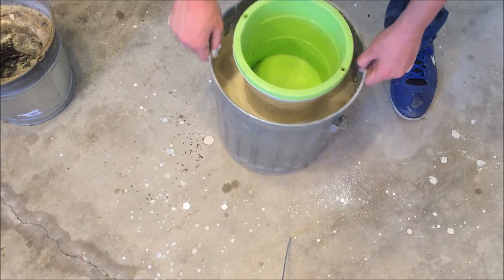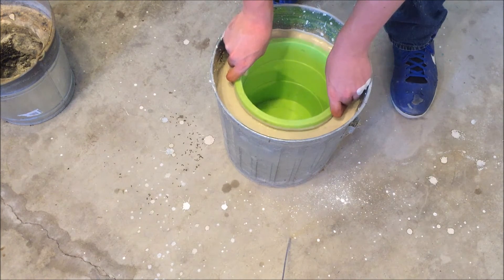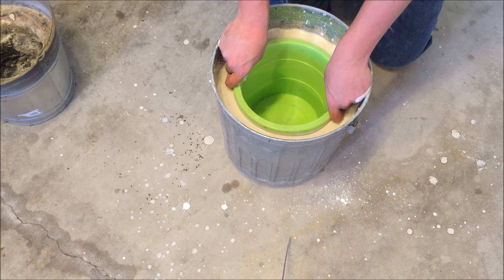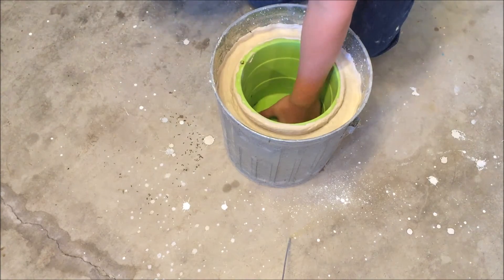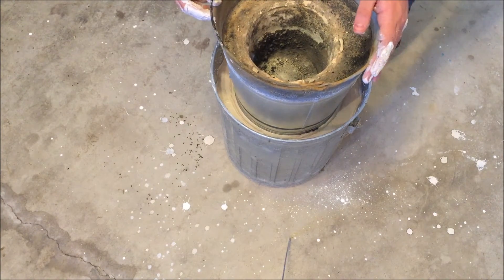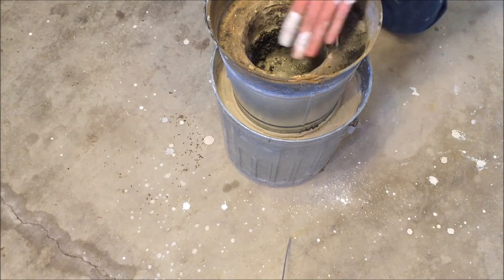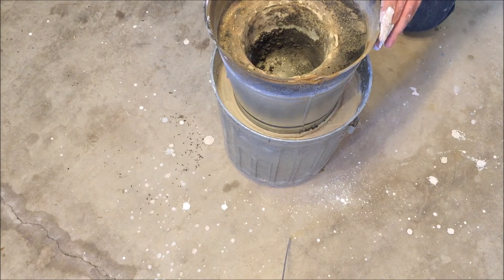Back to the foundry itself. I'm going to push this down. What you want to do is hold this here for a good amount of time until it sticks. You'll feel the plaster of Paris and sand mixture start to set, and that will feel like it's getting warm. You'll feel it's getting warm because that's the chemical reaction that hardens your plaster of Paris. I've set the Mark 1 foundry on top of this — it's pretty heavy so it'll hold it down nice. It's almost ready to pull out, and then we'll be able to pull the bucket out in about a couple of hours.